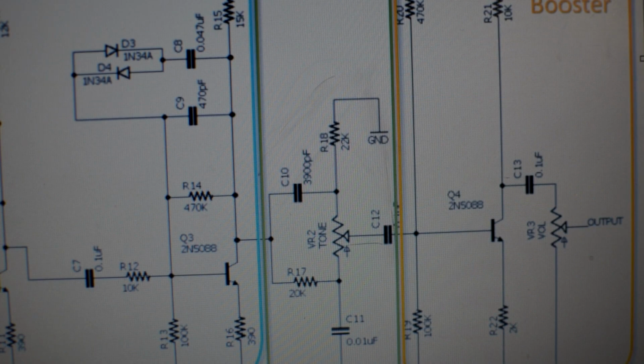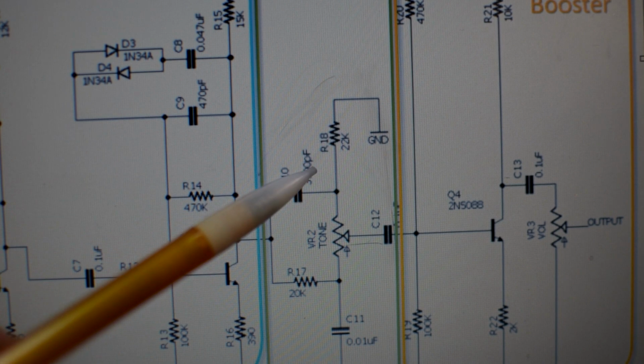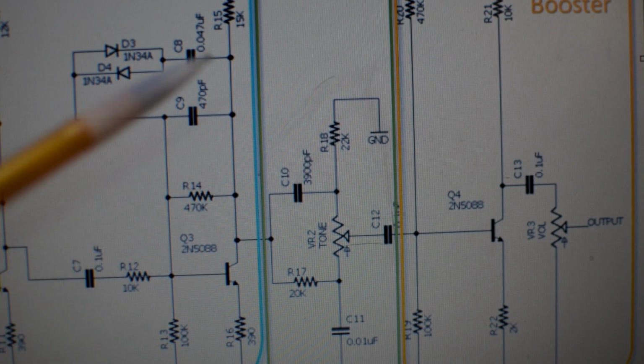I'm going to take this resistor out, and in its place I'm going to put a jumper, which would be right here at this junction between the tone control and the capacitor, and then jumper that out to a potentiometer where I'm going to run it in series with the 5K resistor, and then the other end of it is going to go to ground. So pretty excited about this as a way to help control the mid-range, and you still hopefully should have access to the mid-scoop as well. So we're going to go ahead and give that a shot here on the breadboard.